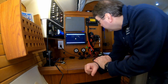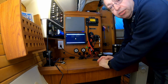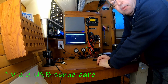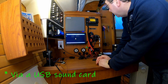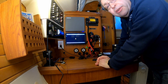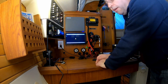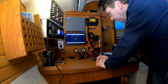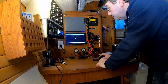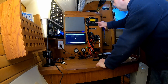I've just fitted this VHF and it's showing AIS and other data. What I want to demonstrate is that I took the external speaker output from the VHF, which is wired on the back, and connected it into the Raspberry Pi audio system. It's connected right now and if anyone was transmitting we'd be able to hear it. I'm going to play a tune first, and then I'll switch the radio into weather mode so you can hear VHF audio come through the stereo.